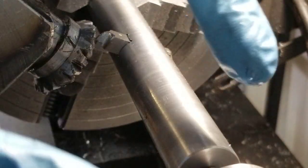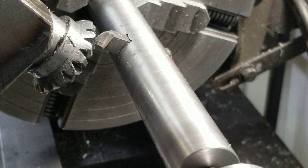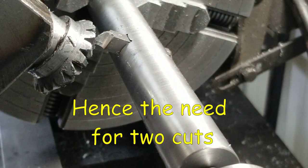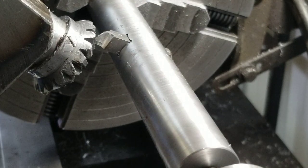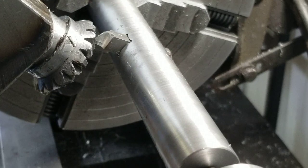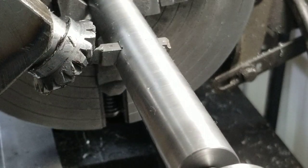Because when you got two diameters for gear, they can't be just straight beveled. They can't just be straight. They have to be more of a triangle shape, I guess. Or conical gears, I guess. I'm not really the best person to describe them, but if you check it out in, I think, page 892 and up of the bevel gear section in my book, the Machinery's Handbook, it gives you a really good description of them.